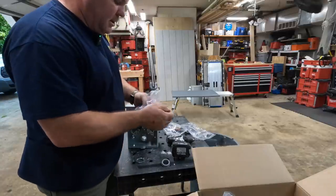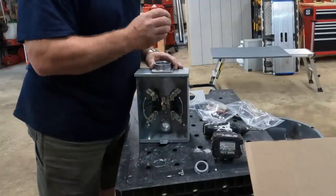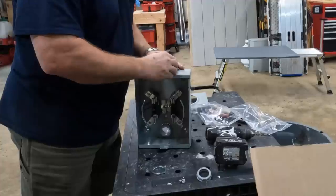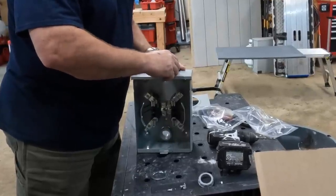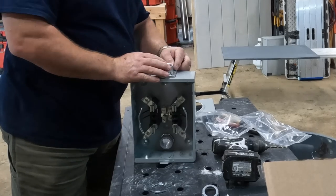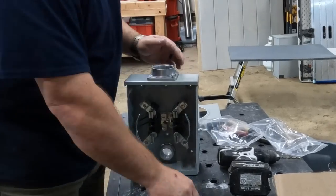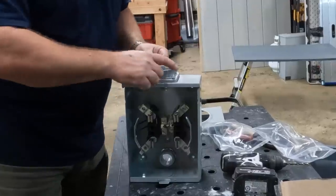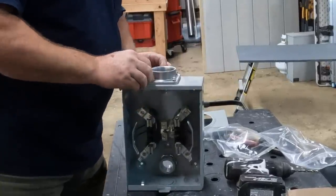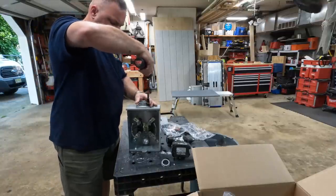Now when you're attaching this hub that sits on top of the meter, these are irreversible. Well, these ones are. Usually they're irreversible. The PSE&G meters have irreversible screws here, which is nice because then you can't take them out. But you have very little room for error. So I like to get these started one at a time and just hand tighten them and then come back with my nut driver and tighten them down. I come back with my 5/16 nut driver and tighten these down.